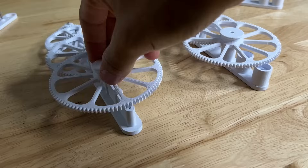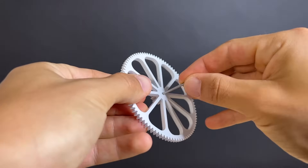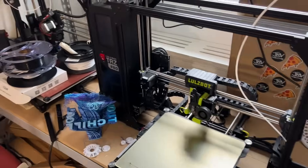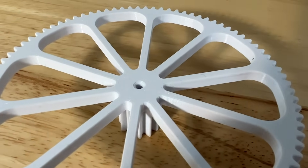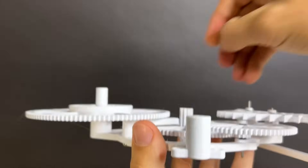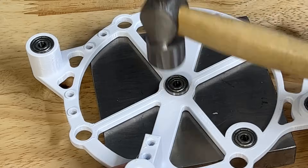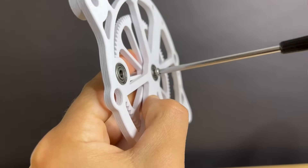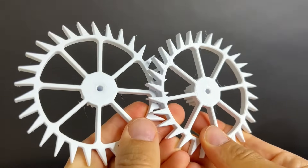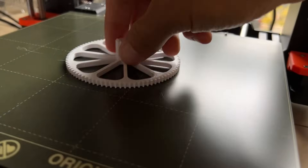I created test rigs to compare steel pins against cheap bearings and M4 screws. The pins have better performance, but the holes in the gears need to be very precise and may require additional drilling. Since I want this clock to be printable on basically any FDM 3D printer, finding exact tolerances is tough. The pins also need to be capped so nothing falls off — already proven to be a pain during testing. Screws and bearings are a little less precise, but much easier to assemble: bearings hammer into 3D printed parts and screws form their own threads, so you basically just need a hammer and screwdriver. This also allows for extra tolerance fluctuation, and with so many different printers printing these parts, I decided this was the best approach.